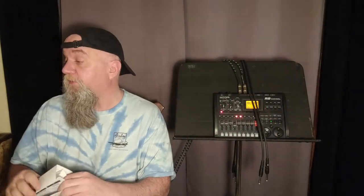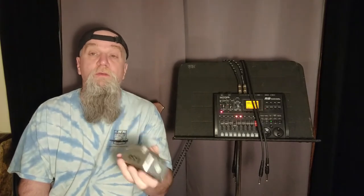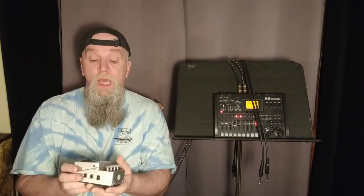I got the pedal and a couple of little things here. I already went online and read the user's manual, so I don't need to read it again. It comes with a manual in Chinese and one in English. One very interesting thing I learned: this is not an on/off switch — it's a bypass switch. When you plug in, it turns on and stays on until you unplug. So if you're running a battery, you need to unplug your guitar when you're not playing.